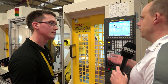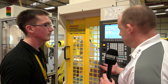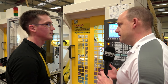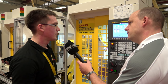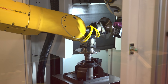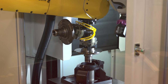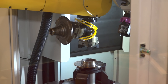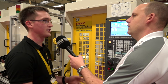So it's very easy to get the two talking together. Now, how does the robot know where a component is so we can start production? Once you've got the I/O set up and communications going, to pick the part — it all comes down to the complexity of your tool, but in very simple terms you use the robot pendant and move it to where the part is, then record that position on the pendant. It's not like G-codes in your CNC; it's what we call FANUC-TP language, very simplistic. You just drive it to a position, press shift-point, record the position, and the robot remembers it.